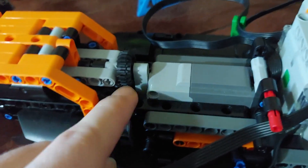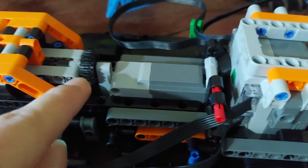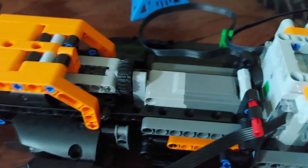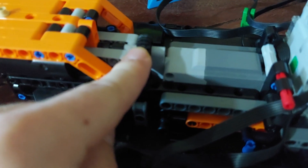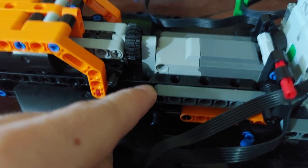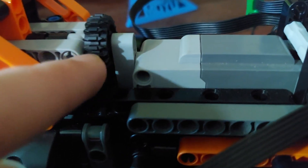For the steering motor, I would have mounted it higher or lower, but I didn't want the eight-tooth gears. I do have a 12-tooth to 20-tooth reduction, and that seems fine for steering. I took out the seat to fit this motor, but I didn't have to do much body work to get this motor in.